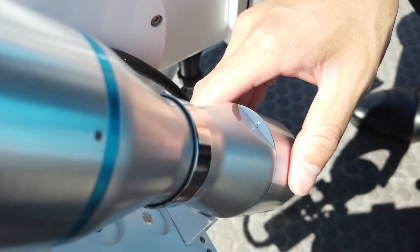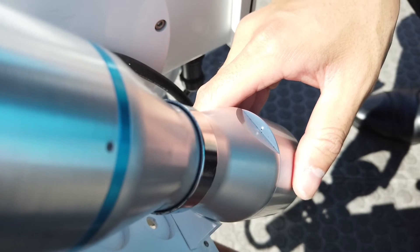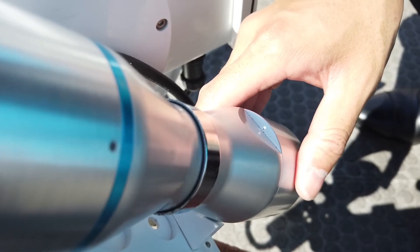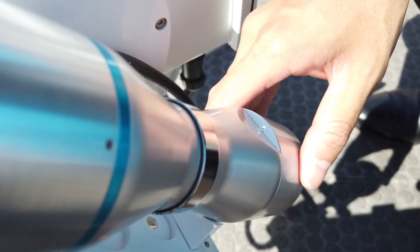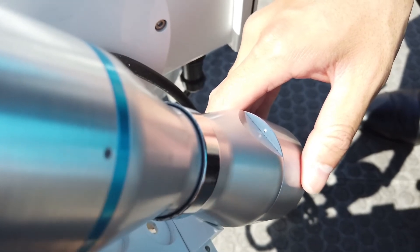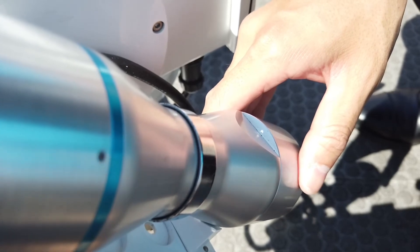The final step is to make sure that the MS-57 itself is aligned. Simply use the adjusting screws until the spot of sunlight passing through the rain cover at the front end of the sensor is centred on the dot in the small notch at the top of the sensor towards the rear.